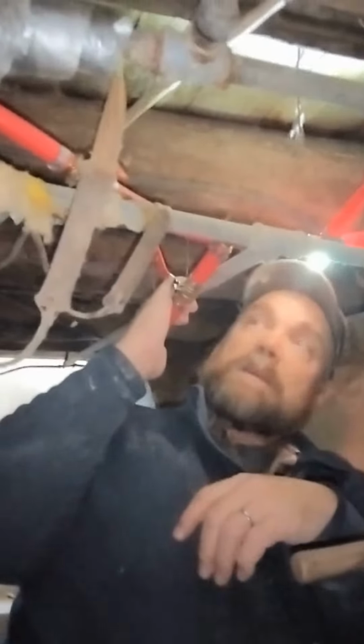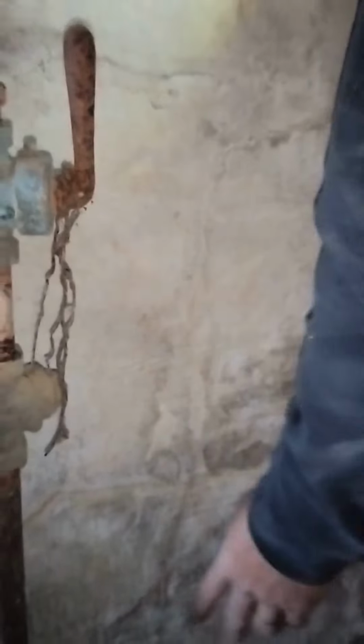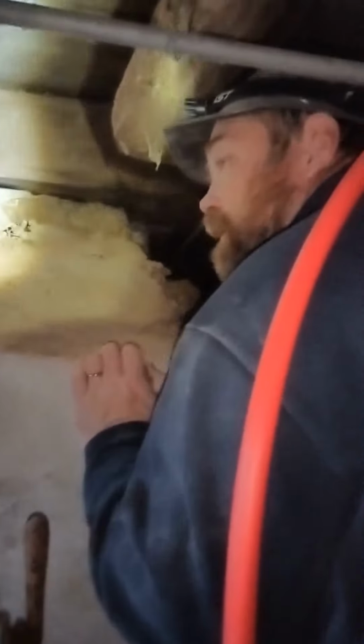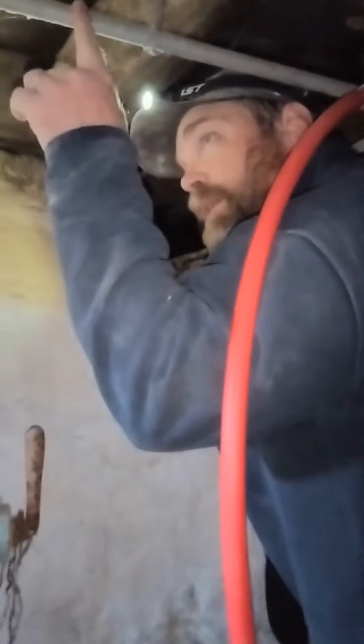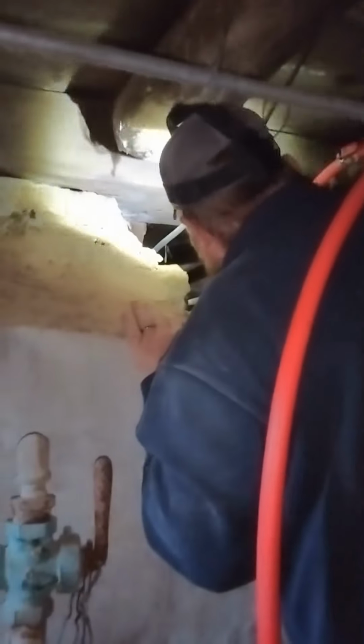And this over my shoulder is going to go to the washer machine. And it'll go to, I'm going to put a water tap right here. Oh, wait, I got to be over where you're at. Okay. So I will put a hot and cold water tap right here over the top of that floor drain, so that we can fill up buckets or wash bins or whatever we need in here. Or run a water hose out the back porch. Yep, run a water hose out to the back porch or whatever. And so I'll put a cold, hot and cold tap here from the cold and hot water lines that go to the wash machine. I'll tap off so when I hit the shutoff valves for them, it'll shut both sets off. Awesome. And then, that's what we've got going on there.